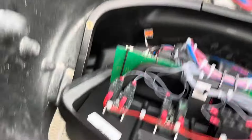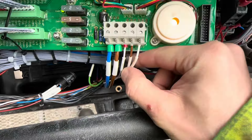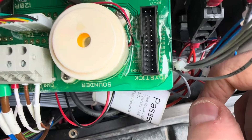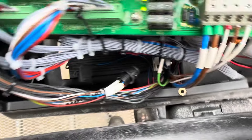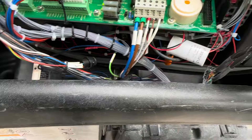That's looking good - this is the CAN high line and CAN low line and they're looking good. The joystick connector is alright and all the terminals are looking good. So let me reset and restart the machine.